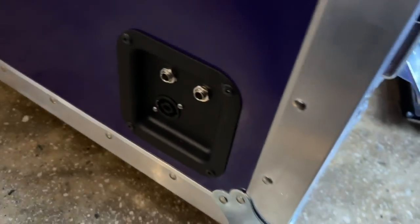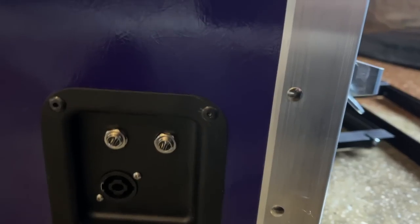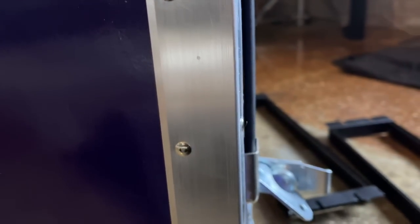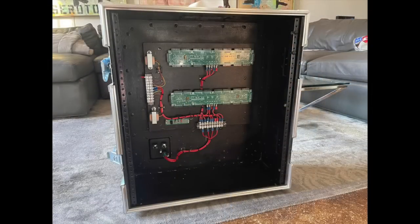Right there — I think this could be power on the bottom and stereo outputs recessed so you can stack it anywhere and it won't be damaged. I then laid in the harness, making sure that the wire gauge was sufficient for the load we'd be dealing with, and the audio path was physically separated from the DC and shielded, and it was all battened down securely.